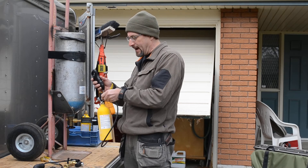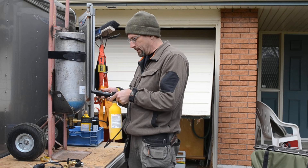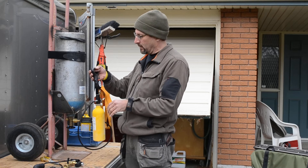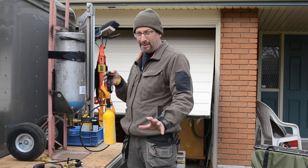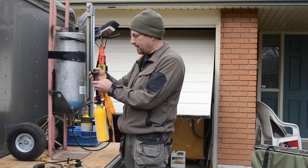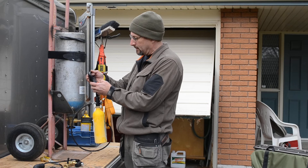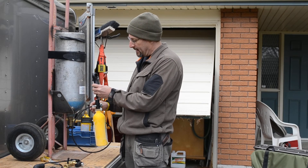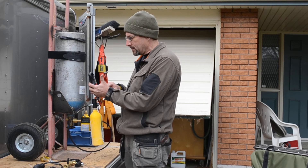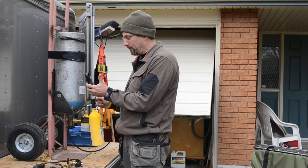You can hear the CO2 going out and the tank will freeze itself. They have a glove or a sleeve that you can fit over this for filling, or you wear gloves, which is also suggested in the safety manual. I've emptied it out and what I'm trying to do is get this to zero. I'm at zero. This only reads in kilograms or pounds and ounces, so this is a 20 ounce tank and I want to fill it to one pound four ounces.